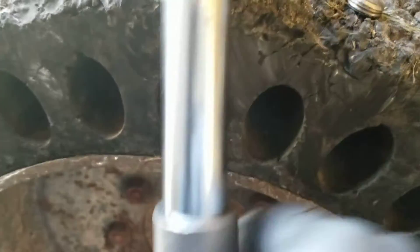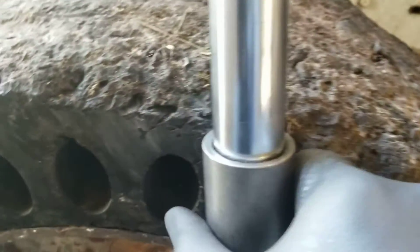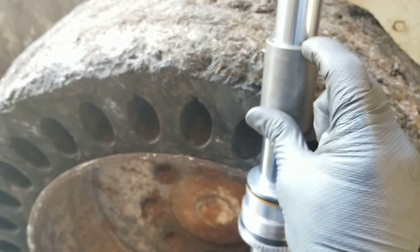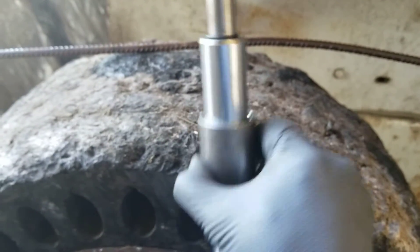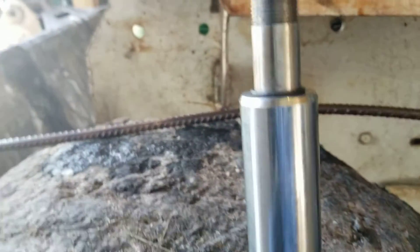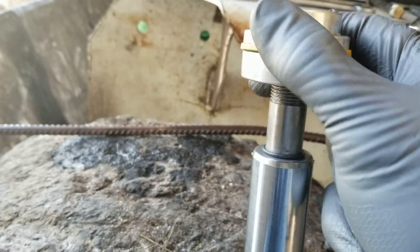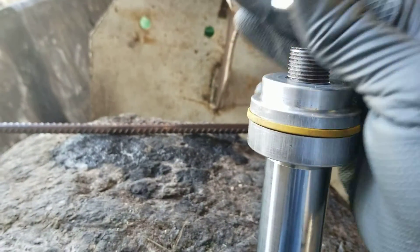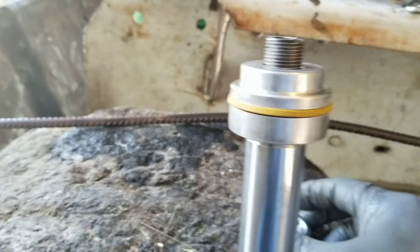This spacer also got real marred up and was stuck on there, so I get a round file and clean the inside of that so it moves up nice and easy. Get the O-ring back on and then the nut. I will be putting some Loctite on this nut. Then we'll slide it into the piston.